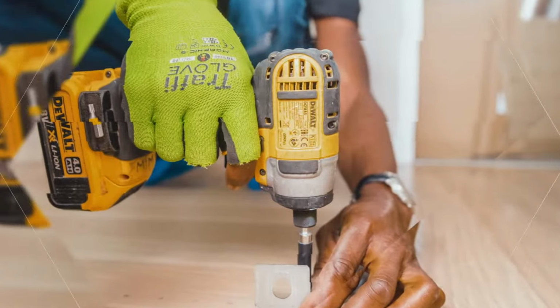Okay guys, when you're out shopping for your concrete anchors, you'll run into these guys. They both look similar and they're both anchors, but this one is the standard concrete anchor and it's made for being driven or fastened into solid concrete. This one is called a sleeve anchor, as you can tell by the metal sleeve that covers the whole shaft or shank. Sleeve anchors are meant for masonry work, brick or cinder block. They're not meant for solid concrete like the concrete anchor, sometimes called a wedge anchor or an expansion anchor. For these reasons, concrete anchors have a much stronger holding strength than sleeve anchors. So when you're out there shopping for your anchors, make sure you get the right one for the job.